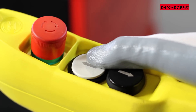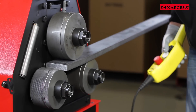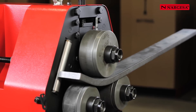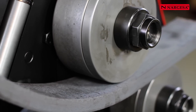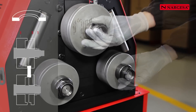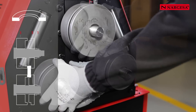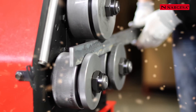Move the machine to the left and repeat the process until reaching the required bending radius. To bend the bar along the edge, the same rollers are required as for the flat side. It's only necessary to adapt the opening between the rollers to the size of the material.